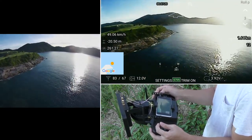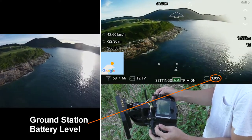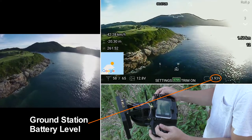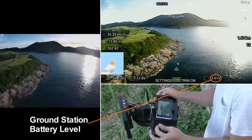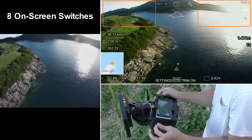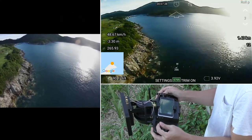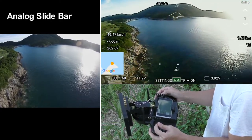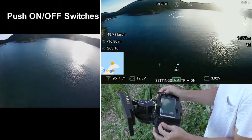At the bottom of the screen we also have battery level of your drone — you don't need any voltage detection module; just wire the battery directly to the SRX8 receiver. It detects the battery voltage level and has a standalone power management system supplying 5V to the flight and FPV system, including the built-in flight controller. We also have the battery level of your ground station. For the S12 ground station, it uses only a single lithium-ion battery for everything including radio, FPV, and the AAT system. On the top of the screen you can add up to 8 on-screen switches, choosing from 12 different types including analog slide bars, 2- to 6-way switches, or push-on-push-off switches.